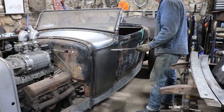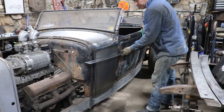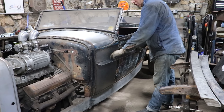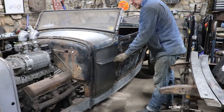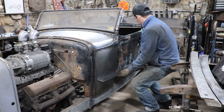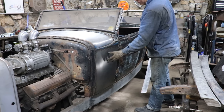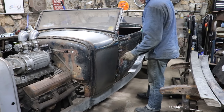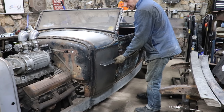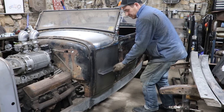We're digging through my sweeps here to get kind of the right shape. We found one that fits the door pretty darn good, and other than where the door has a lot of damage it fits good. We can see that the shape of the door matches all the way to about right here where the panel starts to dive in real hard, which I kind of knew already. But what we're seeing now is how bad the door is down at the bottom — the gap gets pretty bad in here. This is our sweep we want, so we'll put our panel for the other side. I was lucky that this panel on the car when we started was pretty decent, so I shaped it to match that. Now we're trying to match this panel, so we've got this sweep that matches the door. I'll make some marks so we know about where the panel starts to sweep in real hard, and we'll use this for our reference along the way.